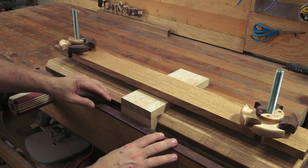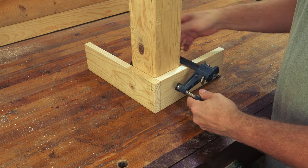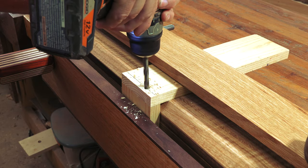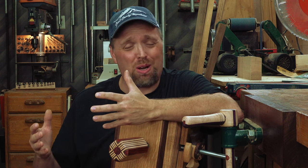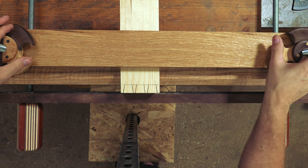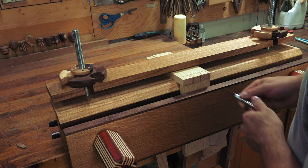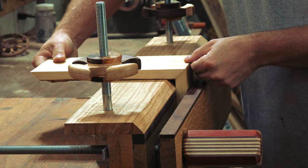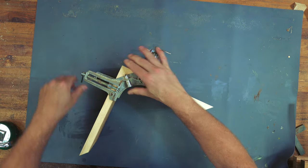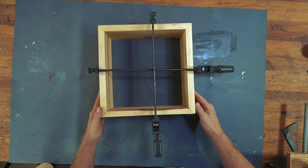Keeping the joint locked in position has a number of benefits. I personally like making dowel joints, but usually it means I have to drill out the face first, find some way to clamp it at 90 degrees, and use the first hole as a template to complete the hole. Working with the upper vise, I can clamp the entire joint together like a giant corner clamp and finish the joint with a single hole. If I'm doing a dovetail, I can start my tails in the vertical jaw and then transfer it to the horizontal jaws to mark out my pins — much more reliable than trying to hold stock freehand. Larger miter joints can be clamped together during glue-ups. Being able to do two corners and then put the box together later is far easier when you have two sides that are already perfectly parallel.